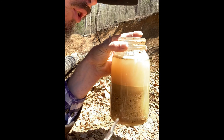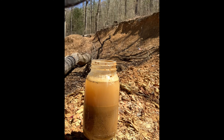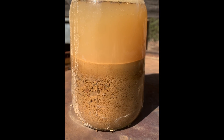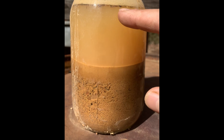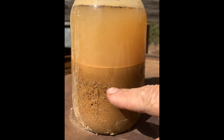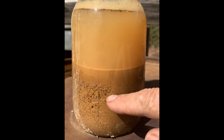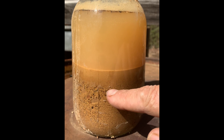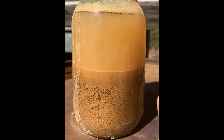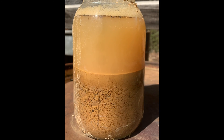Anyway, that's your basic, very simple soil test to determine clay content in your soil. This is after about maybe an hour and a half, and it's a lot more clearly defined at this point. Once all this settles out this level will rise just a bit. But you can clearly see this defined line right here where all the aggregate sand, gravel, and stuff is down on the bottom versus the clay that's right up here on top. That's probably a little bit less than 25% — maybe closer to 20% clay versus the rest being something else.